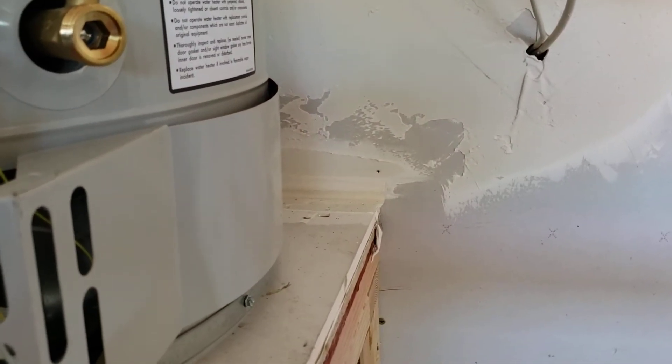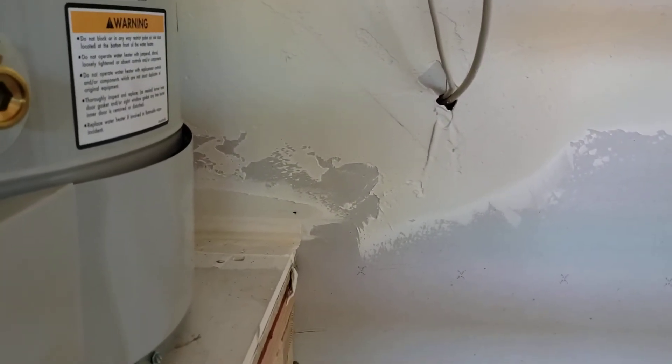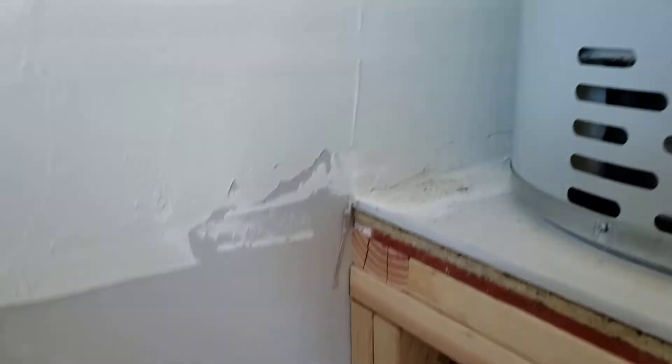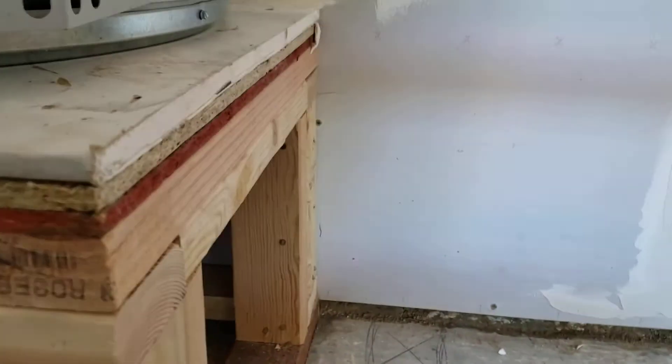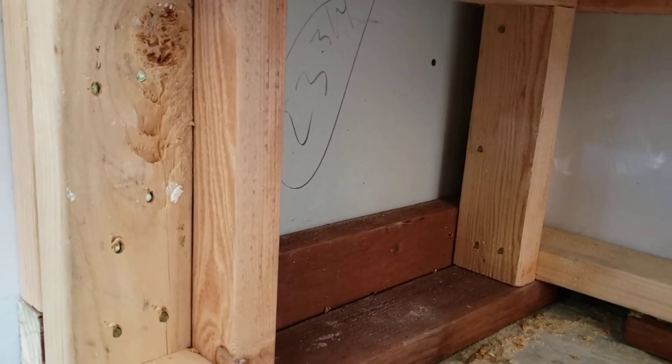This was a little more interesting — there's about a 3/8 plywood shear wall behind this sheetrock, and we looked at that and it was wet. We pulled everything out and reinstalled some OSB board in there, so that's brand new. There was a little more damage up higher — this is about two feet off the ground, over there it was about 30 inches off the ground — so we cut it up a little further and put a brand new piece all the way up to that joint line. We are not drywall contractors, but we wanted to get you a new stand, remediate the water, and get you new sheetrock on the wall. Now you can come back and put whatever you want — sheetrock, tape, texture, paint, or wood — because it's sealed at the wall. It's 5/8 drywall, which is fire rated.